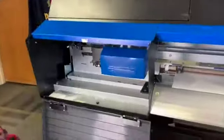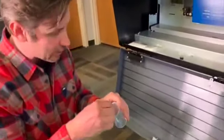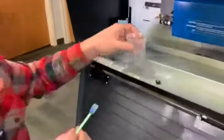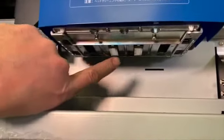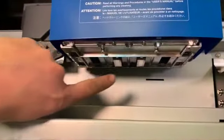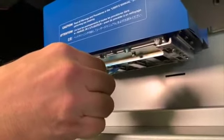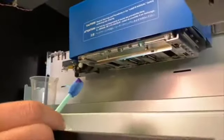Put a little bit of cleaning solution in the cup — not much, because I just cleaned this not long ago and it's still pretty clean under here. But I wanted to show you how this is done because we were running into some banding issues internally and people were wondering. If you can bring the camera right underneath, you can see the print heads. On the SG version we have two print heads: CM on one side and YK on the other. On the VG you have four, and you can see there are open slots for the VG. If you've printed for a while and haven't cleaned, you'll notice a considerable amount of buildup around the edges.